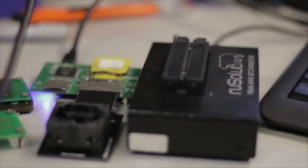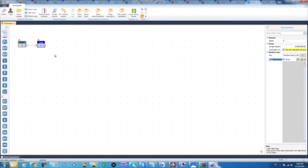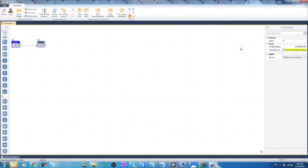This is hooked up so we can read. Now we just need to open up NAND Reconstructor. What we have to do really is select the card reader — it's the MMC. And this side here, we selected that: Multiple Flash Reader. This is the green card we attached to it.